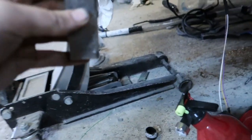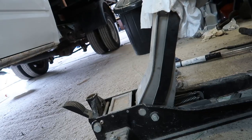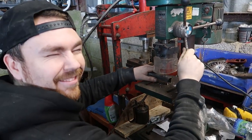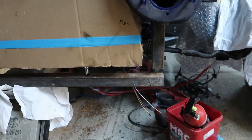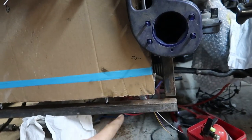So this is what we've done. I've marked two little holes — basically I'm going to drill two holes and then have a bolt and washers going through there. I'm going to drill the holes now for these. Always use your safety glasses. Just marked where these little bits go and just need to drill the holes, then we can weld this up. I know this massive box steel tubing is way excessive but it's the metal we've got, so it saves us buying more.